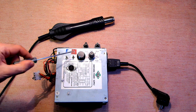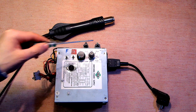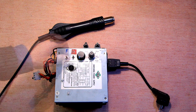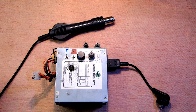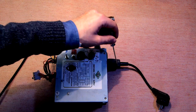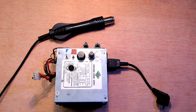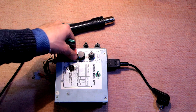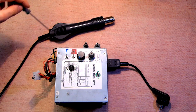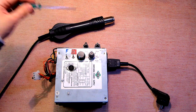Now the most interesting part — these two switches. After I switch on the power supply for common needs, for example a 12 volt output, these two switches are off. This first switch turns on the DC-DC boost converter and the fan starts working. Besides that, it connects the mains voltage to the second switch — so without the cooling fan it is not possible to turn on the heater.